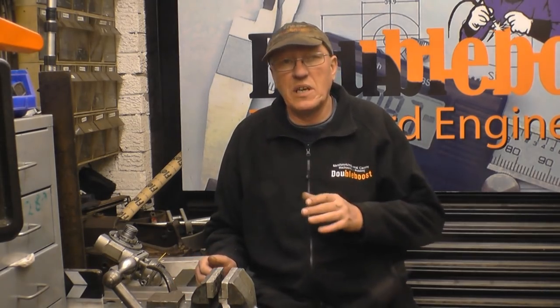I used the plasma cutter to cut some copper washers out for Richard's steam wagon. The big diameter washers are 4mm thick, about 40mm diameter. I've machined them before from plate and tried machining out of solid bar, but copper is horrible stuff to machine. I thought, why not cut it with a plasma cutter — because the plasma doesn't care about the material. So I did a little drawing, created a programme, and cut the washers out. I was quite impressed with the finish I got on the copper. It takes a lot of amperage to cut it because copper tries to shed the heat very quickly, but it worked quite well.